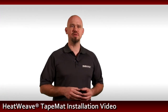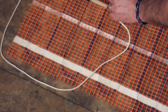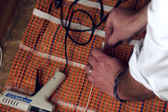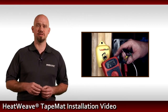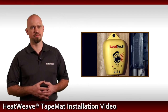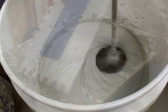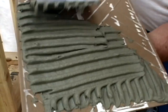Once the mat is secure, it's time to install the sensor. Position the sensor parallel between the heating elements. Do not cross over the heating wire. Hot glue the sensor to the floor. At this time, perform another resistance check of all components and record these values in the installation manual. Once completed, reconnect the LoudMouth. We recommend using a latex modified 3/8 inch thick thinset. We also recommend using a plastic trowel, such as our cable trowel.